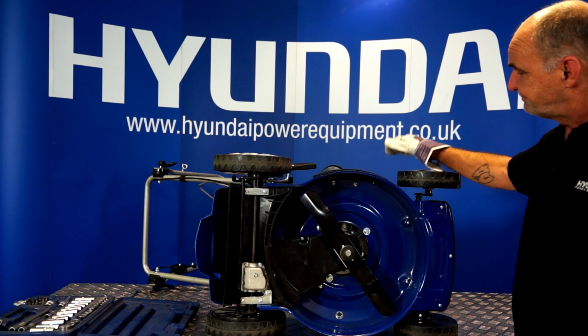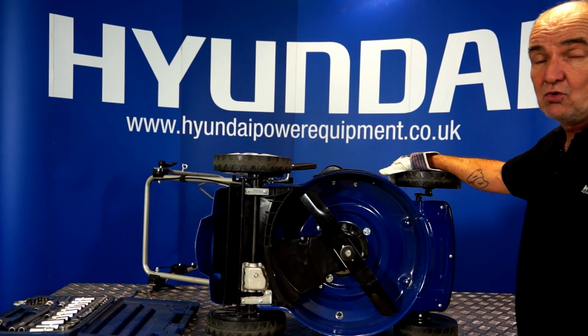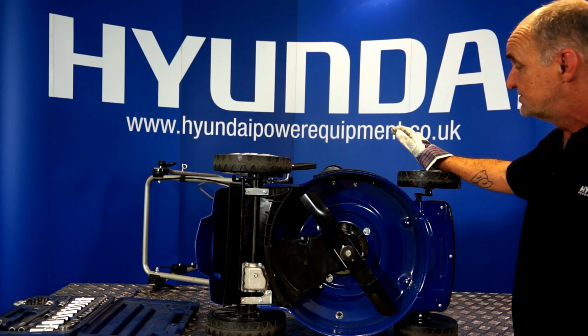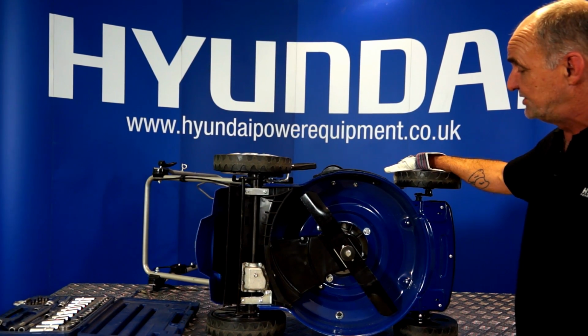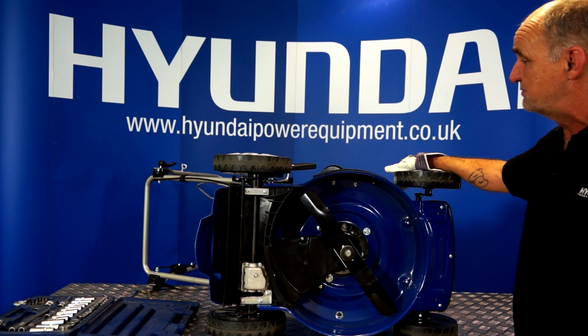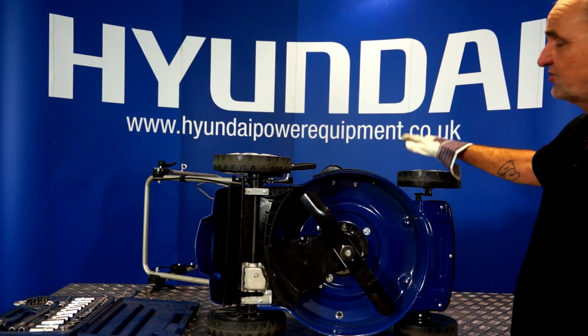Now, as you can see, I've laid the mower up onto its side. I recommend that you drain all fluids before you do this. So make sure there's no petrol in it and drain the engine oil. If you're doing it as part of a normal service, that would be a good time to give it an oil change as well. So drain the engine oil and the fuel first so we don't get any leaks and make a mess everywhere.